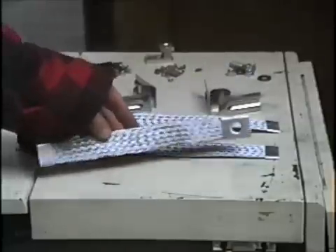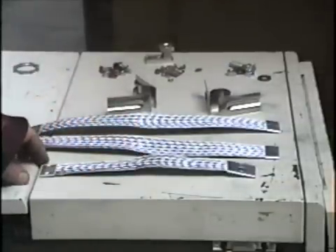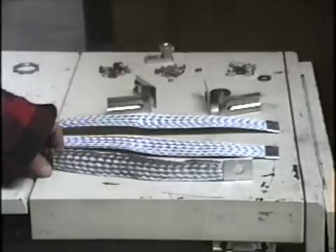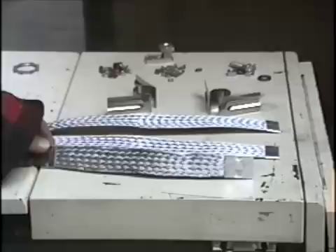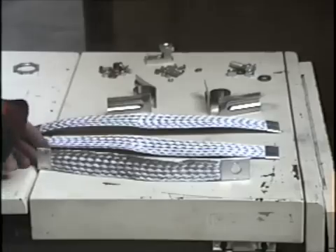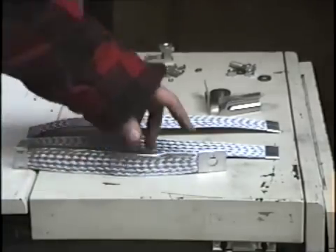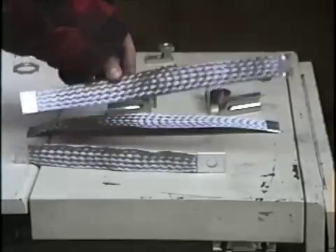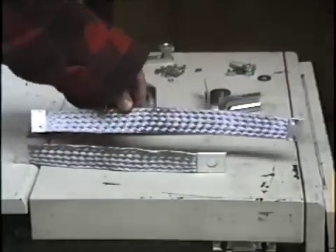This is a braided aluminum wire rated at 100 amps. I chose the 100 amp option even though this furnace is only going to draw about 50 amps because I want everything a little bit overbuilt. With these resistive loads, I would rather be on the heavy side. These ones are punched at the ends for connection, and these ones are just straight jumpers that go from one element to the next.